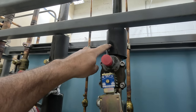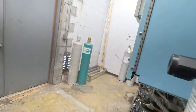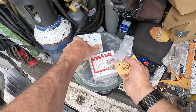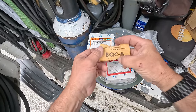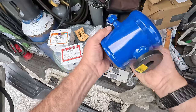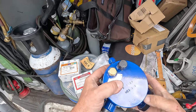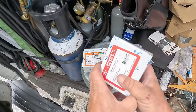To be by the book, you'd want to pull from your Schrader port here, pump that refrigerant back into the suction rack header, and then go out and do the TXV change. We have a build-a-valve style: a valve body, a head, and a cartridge — the cartridge can be changed to whatever tonnage you need. We also have our oil float here: it hooks onto the side of the compressor, has the float in the front with a sight glass, adjustments on top, and a fill port.